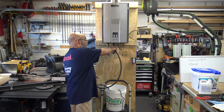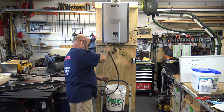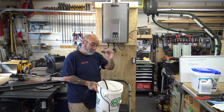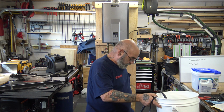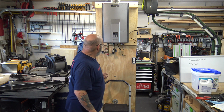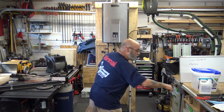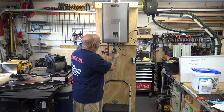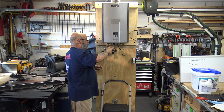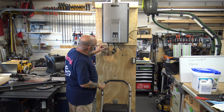Then you're gonna take off your pump side. Then reach into the bucket and don't forget the filter. So let's get this out of the way. Don't need this for now. Okay, so you want to pop the relief valve, get the water out, get the solution out, shut off your 2 service valves, and then put your caps back on.